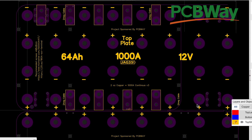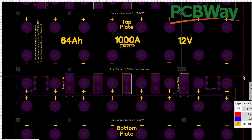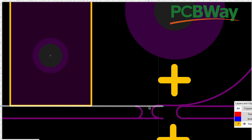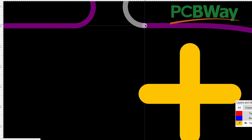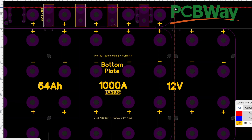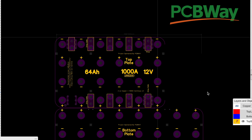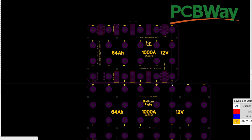We're putting the terminal blocks on the sides here. We start by moving the edge of this design back, eliminating two of those rows, moving all the lines and making sure everything is realigned. These are breakaway tabs because this is a top-and-bottom design. I didn't want to make two different files because people get confused easily — this way both the top and bottom board are in the same design file. When you get it you just break it apart and then assemble your battery.